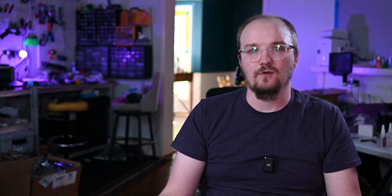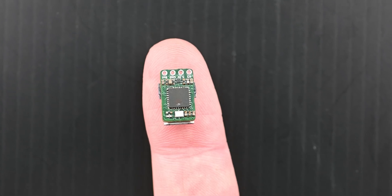And it works. Sort of. I put an RGB LED on this thing to make it fancy, but in my haste of making this thing smaller for REV2, I put the RGB LED on the back of the board, and when I did that, KiCad mirrored the footprint, which meant the pads were not in the correct orientation. In any case, the core functionality of this thing works, which is awesome — I'm really happy with that. It's an itty-bitty ESP32 that if I ever have a project where space is an absolute consideration, I have that option now, which is pretty cool.